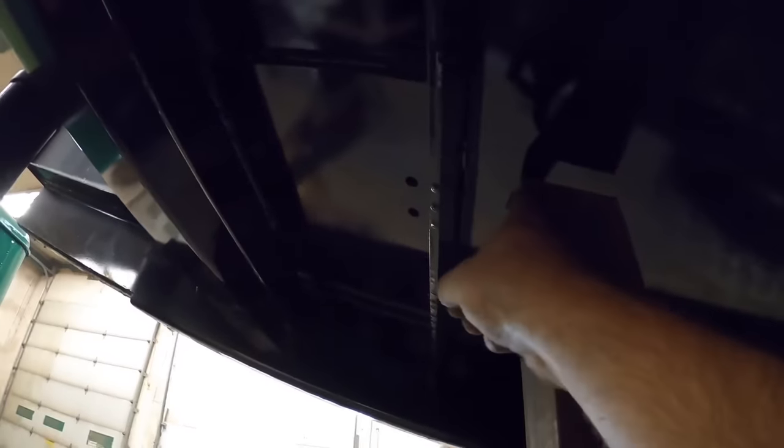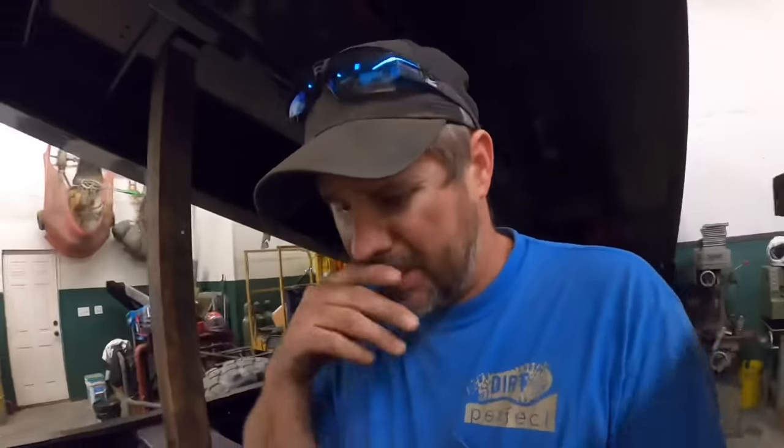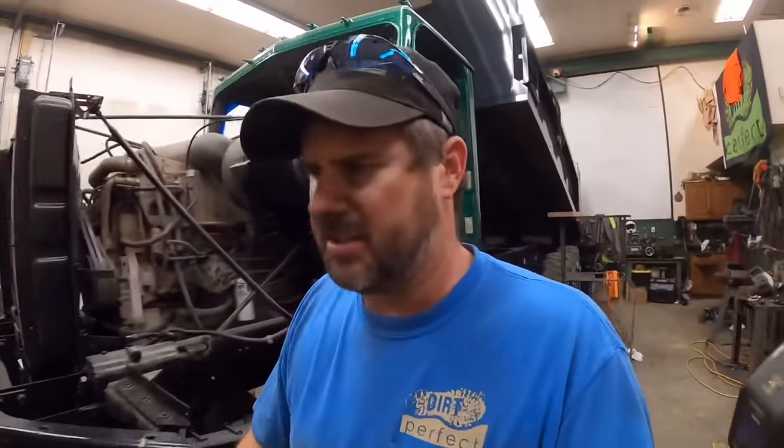We're gonna modify our prop a little bit. See this distance offset right here? That's what we have to do to get this to come down square. I don't want this thing in here at an angle. I don't want a point low in the floor. I don't want a chance for it to slip. The safety prop's just not something we want to half-butt. So we're gonna basically make a shoe to go on top of that. It should hopefully fix a lot of our problems.